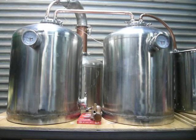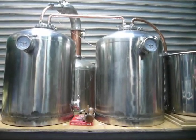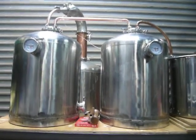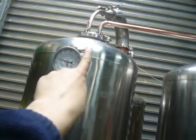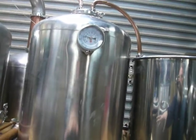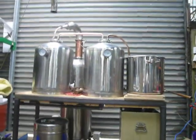This one's going to start going nuts first and then the second one will carry on. What generally happens is the still gets up to temperature, starts producing a lot of vapor, starts running at product temperature, and then this first thumper's liquid will suddenly come up to temperature and spike. I'm assuming it will run in tandem as they do individually. Then the second thumper's liquid temperature will come up to the right level and the temperature in the header will spike — then I'll start seeing product. I'll come back when something's happening.